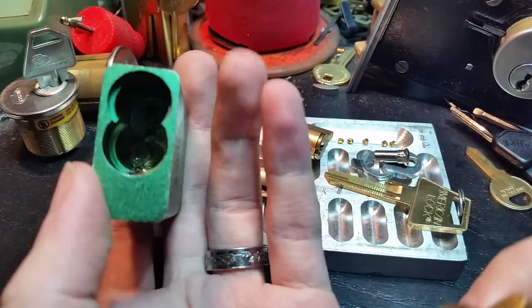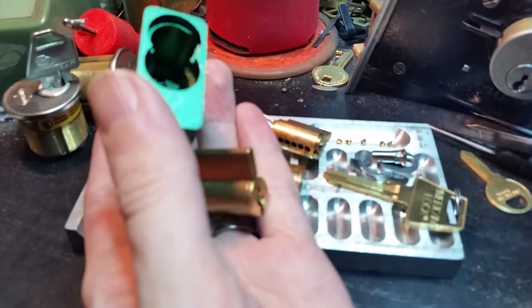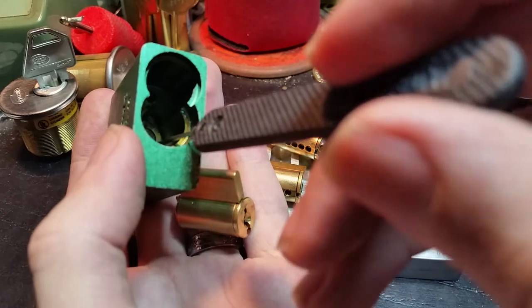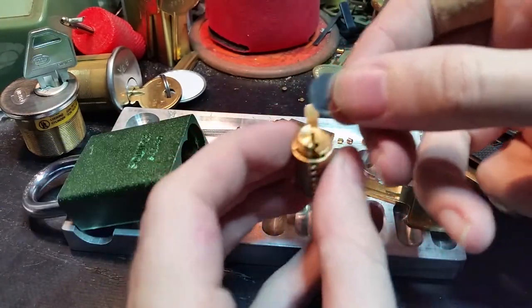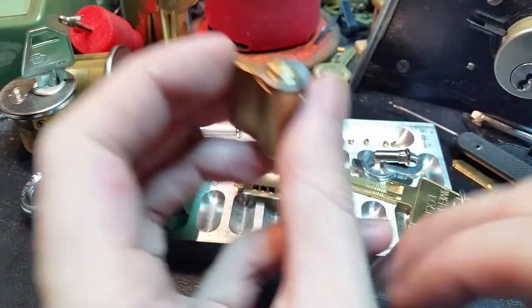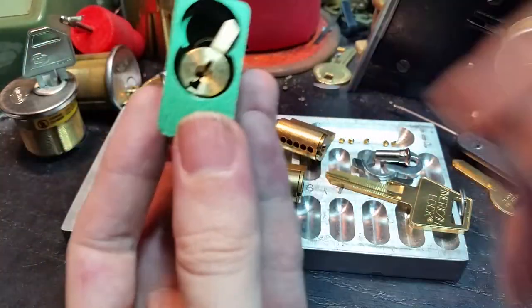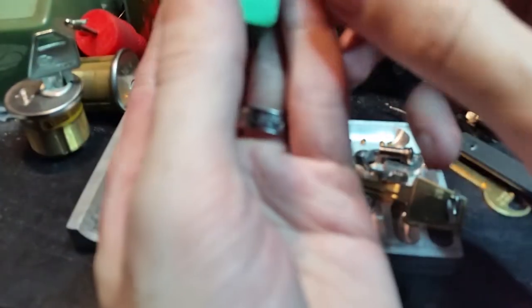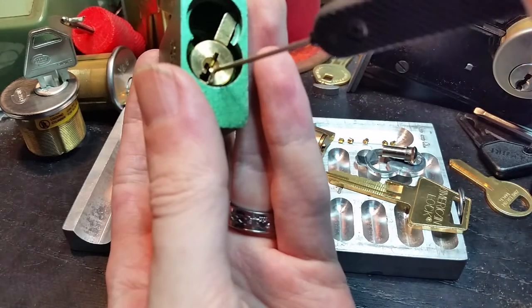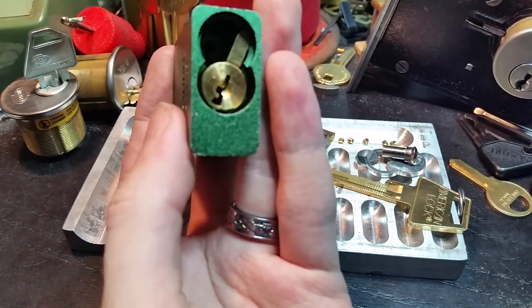Because it is still the standard American Lock cam, and we've proven that this little bypass tool will work on those, we do need to take a little bit of extra precaution. We just take these two little thin metal plates, stack them on the tailpiece of the cylinder, and drop that into the lock body. Now that bypass tool isn't going to work, and if we use two of them, even the wafer breaker tool that's meant to punch those out is going to have a hard time.